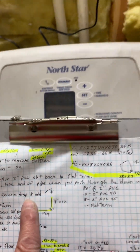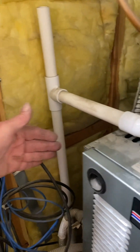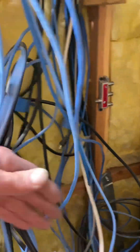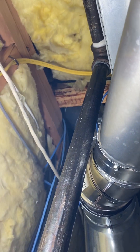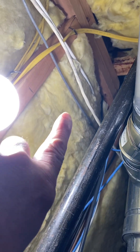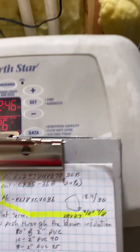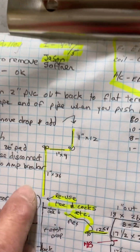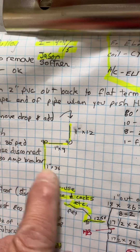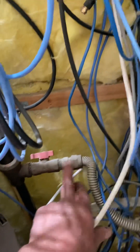The furnace is going to be moved over five inches from here, so we're going to have to move the gas. We're going to take the drop off right there — put a 12-inch one-inch by 12, and a 90, and a 90, and a one-inch by four, and a 90 to get it down closer to the wall. Then I'll make you a one by 36, and you're going to reuse all this existing water heater pipe and cock.